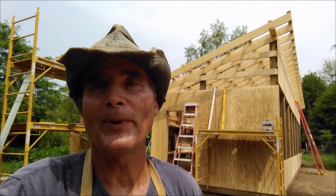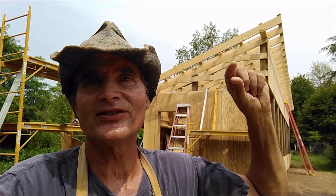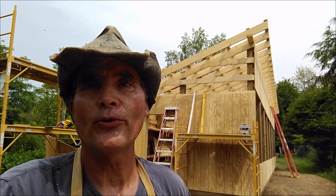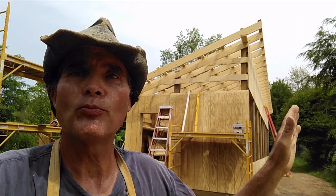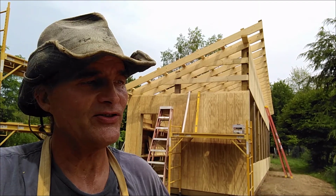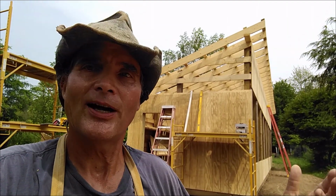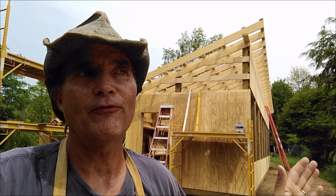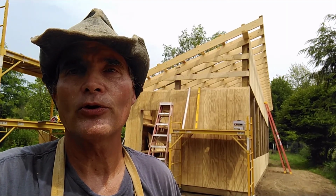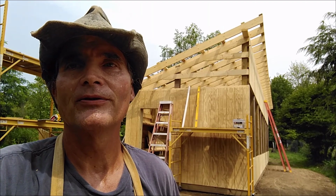So to prevent that from happening and keep it all equal distance from the top, that's what we should do, is go through that process of establishing two plumb lines, which are vertical level, at a prescribed distance. Since these are 4x8 sheets, I'm just cutting them at four feet apart, so I know I need to make a difference of 16 and 3/4 of an inch per sheet.